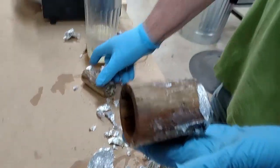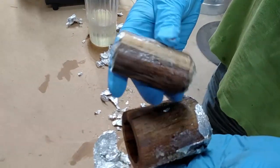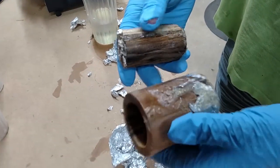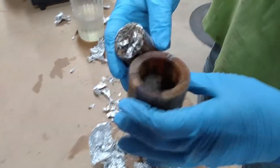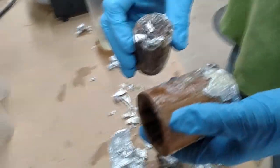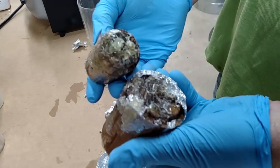We've taken it out of the oven. It's had the stabilizing fluid in it. You can see some shine on it, the acrylic. When it's done, there should be no liquid dripping, and you should see some crystallization. You may get chunks in the bottom or inside if you haul it out like this, but it ought to be shiny with no liquid.